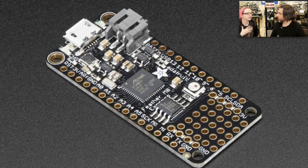It's like a super hardcore Arduino board but also a really good beginner Python board. The neat goal was: what if you didn't need an IDE? What if you can just plug in, it shows up as a drive, you double-click it, edit the code right there, and that's it. CircuitPython is in beta — we're still working on it, so things might be changing, please be patient. It also comes with a special mass storage bootloader, so if you want to update CircuitPython or use it with Arduino code, you can drag and drop files onto the bootloader. You don't need a JTAG or any command line utilities. You can program it from a Chromebook or even an Android device.